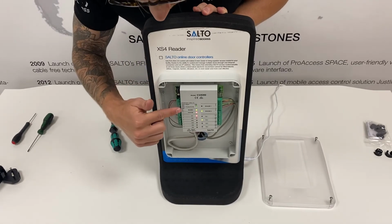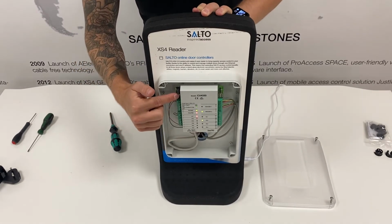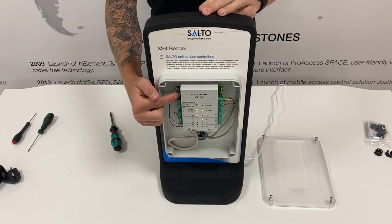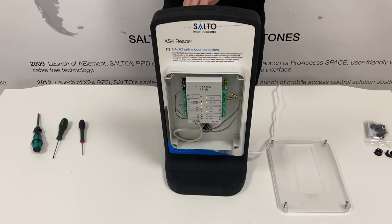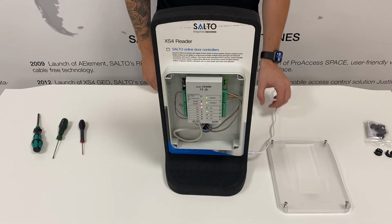It's always recommended to test that the wall readers are wired and connected correctly. To do this, ensure the tamper loop is red and open, and press the clear button once. If both wall readers are wired correctly, you should see 2 orange flashes. This indicates there's no cable faults or damage.